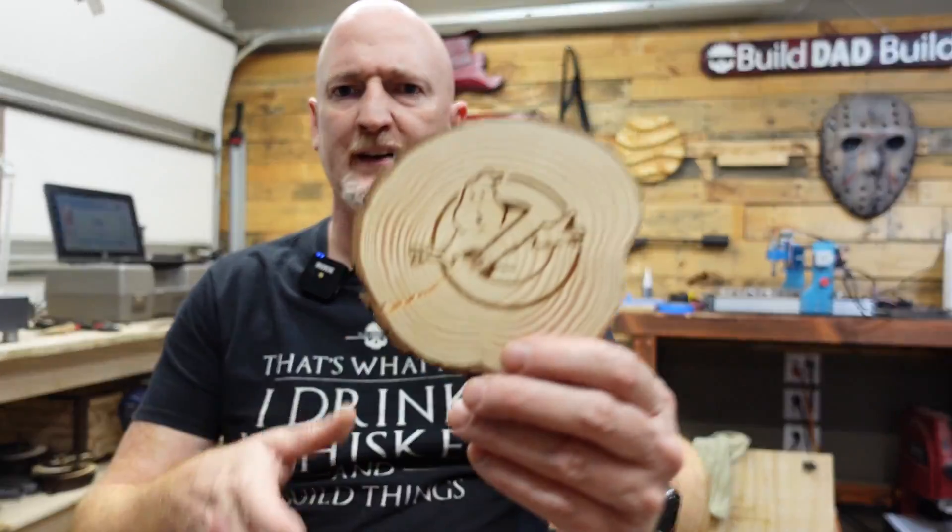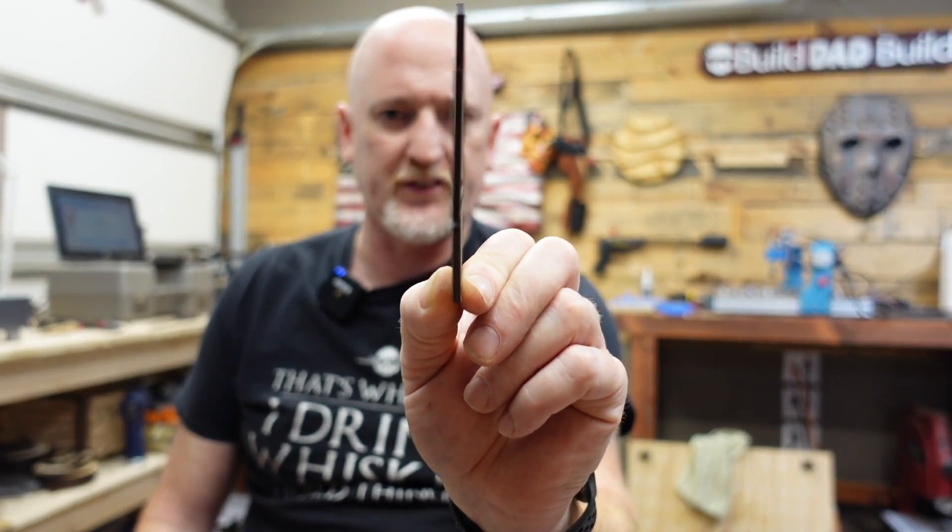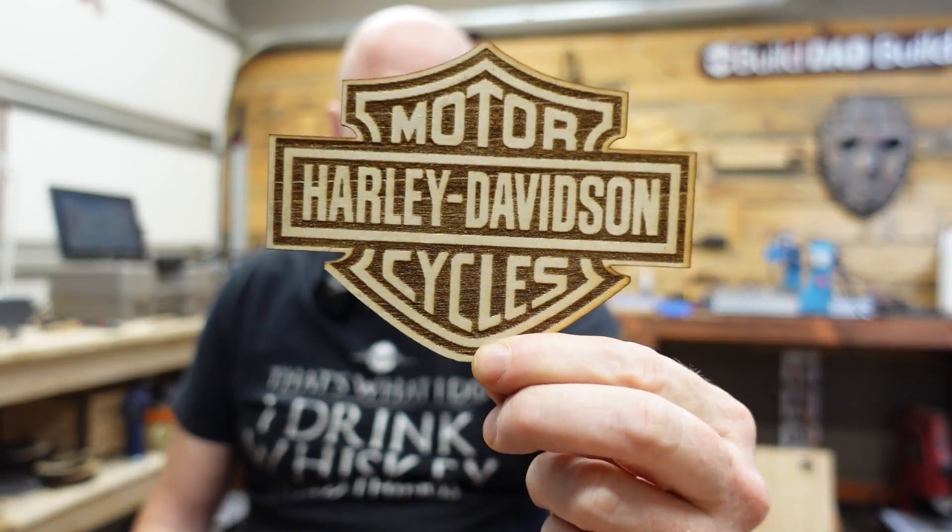They sent me a little tree trunk slice — we got a little Ghostbusters on there. After I ran the Harley logo I wanted to do another one, so I did a cut and an engrave on a thin piece of about three-millimeter plywood. Keep in mind I'm doing all of these in their proprietary software, LaserBox. The D1 is now compatible with LightBurn, but I just wanted to show how capable their proprietary software is. It doesn't have a lot of bells and whistles but it has decent presets, like being able to select 'basswood 3mm' from a dropdown.